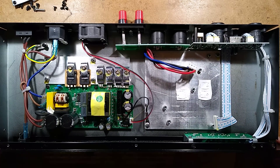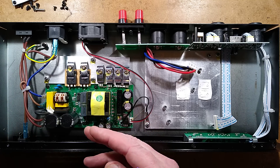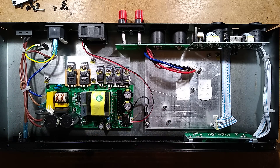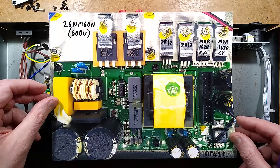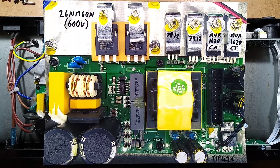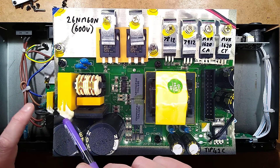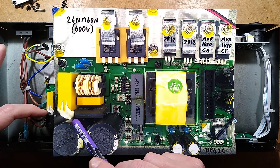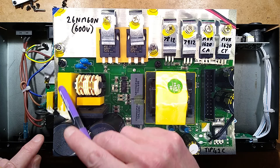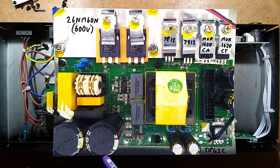I went a bit further than I was expecting, but let's take a look at the power supply for the amplifier section first. I've taken pictures so we can zoom in and point at bits. The incoming supply goes via this big metal oxide varistor, and there is some filtering circuitry, the bridge rectifier, and then super-large main capacitors.